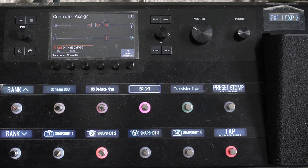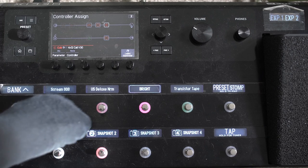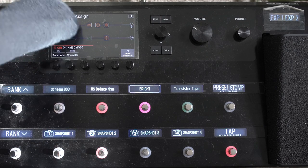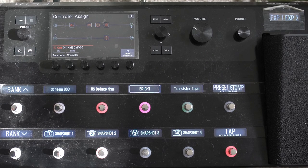and whilst that might be realistic, you know, the thing is that normally if we're hearing an amp in the room as well, we get a bit more of that kind of smiley face EQ, right? Because you get a big low end and you get some of that spiky stuff as well, as you know. So I thought, well, we could do what the Blues Driver does and kind of stick a tone stack here in front of the amp.